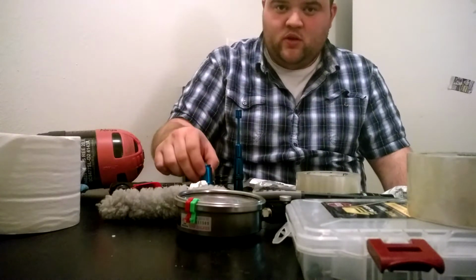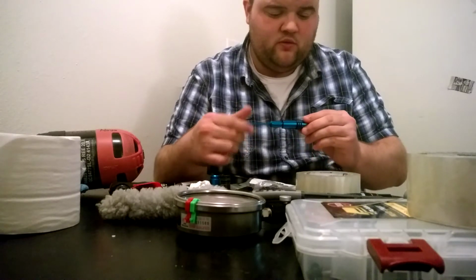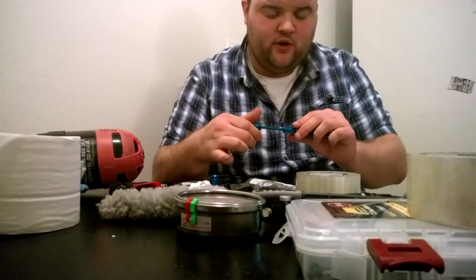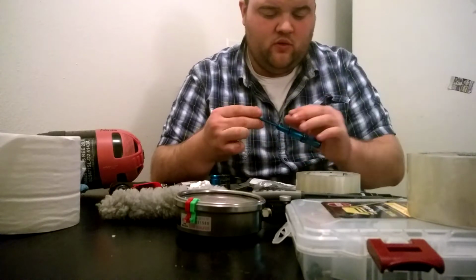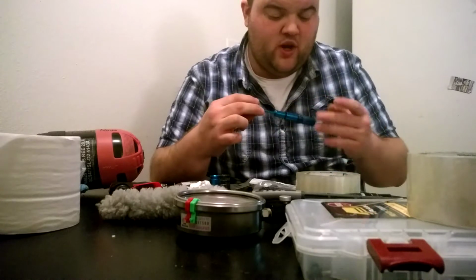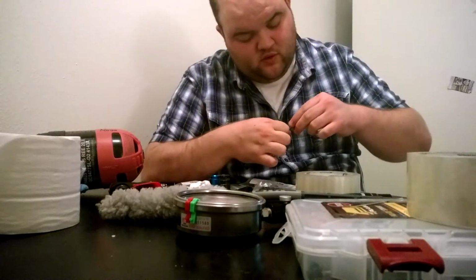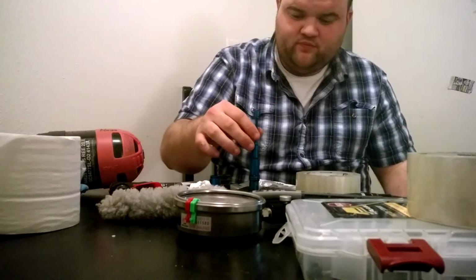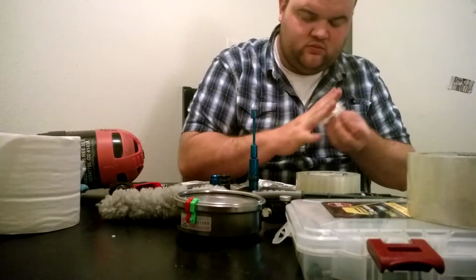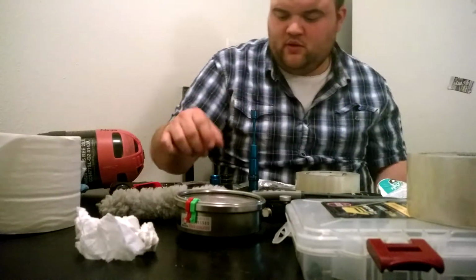Okay, so lubrication. Try to do it exactly the same every time. A clear coat on the bolt touching on the friction critical surfaces, a clear coat on the O-rings themselves. And here I'm making them wet, and I'm trying not to let any color of the grease show. There's a hole in it right here, which gets everywhere.